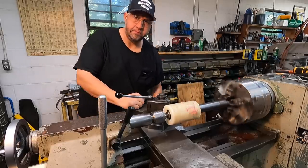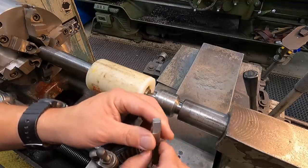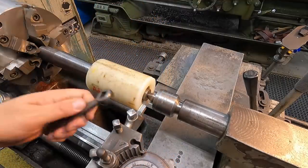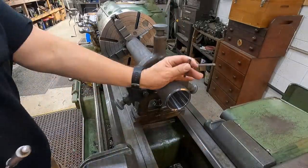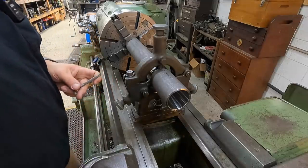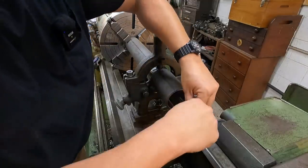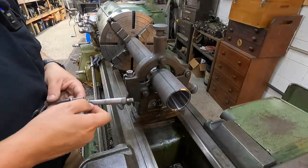Ready to turn. I'll be using my high speed turning tool — I went ahead and touched up the side on the grinder because I could tell the edge had a little wear, then honed the radius real well and honed the top so we have that razor sharp cutting edge with a nice smooth radius to make a good finish. I believe this is nylon. Just getting a few measurements on this pipe that we bored so I can see exactly where it landed — it's nice and cool now. That right there is seven under — so close to the three inch nominal size, three inches minus seven thousandths, which is two point nine nine three.